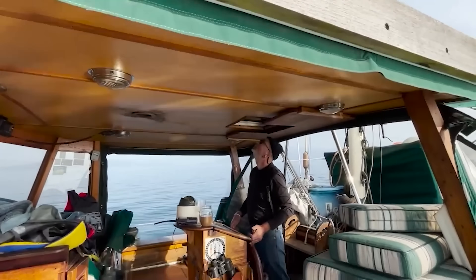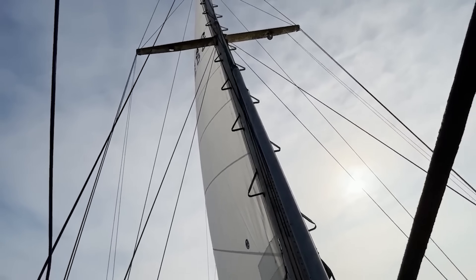One thing you really need to do with a $1 boat is everything. You need to rip out all the electrical almost always. The electrical is always a bit of a nightmare, and being able to save some of it really will make your job a lot less. In my case, I wasn't able to — I made the call to tear it all out. The circuits you really want to keep are everything that goes up the mast, and then all of the lighting circuits. The lighting circuits run freaking everywhere.